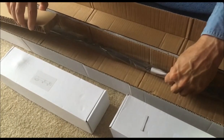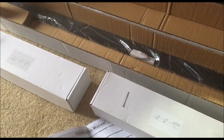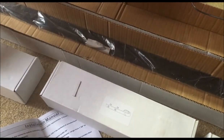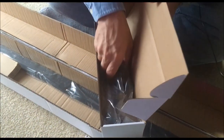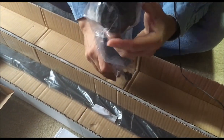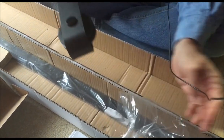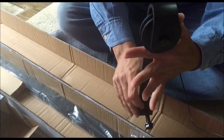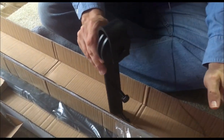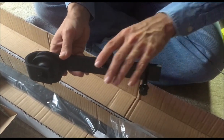We also ran into the issue of having a door frame, so I would have had to add spacers and do extra work to make sure everything was level. The kit comes with two hanging dollies — these pulleys ride across the top of the track, so you'll want to make sure you have enough clearance space above your doorway. It has nice heavy bolts that go through the door and hold it in place. It's a heavy-duty design.